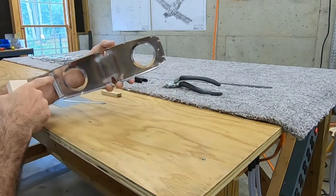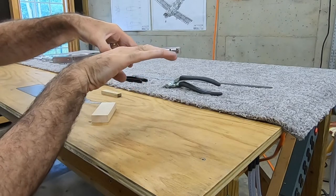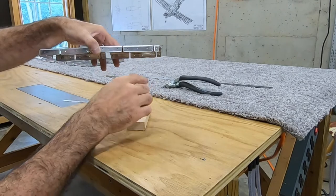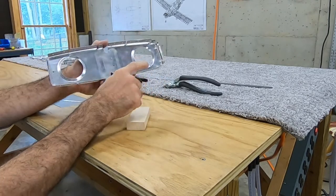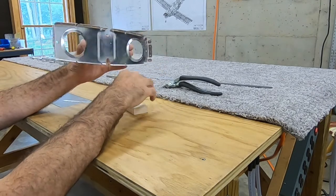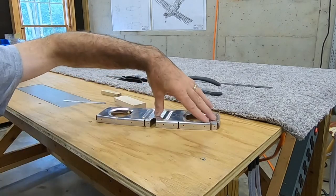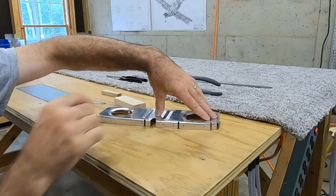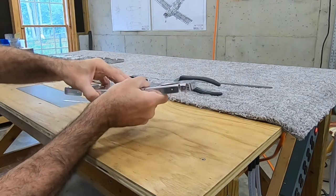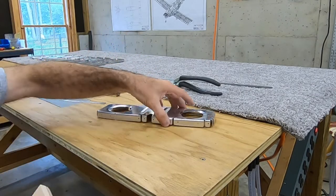I'm not going to go too crazy trying to get the end flanges up against the spar to 90 degrees yet, because when I start fluting and pull this in it'll change the angle. But I don't want to flute before I try to get them to 90 degrees, because I won't be able to get my block of wood on or use the hand seamer without squishing the flute back out. So I'm going to try to get these to around 90 degrees with the blocks of wood, then come along with the fluting pliers. That bow in the web I'm not concerned about since it'll be held in place once it's inside the skin.